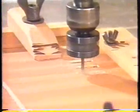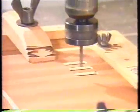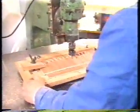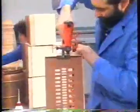During this phase, we can see, for example, how the bottom of the accordion base is worked, how the holes are made for the air which passes through the reeds to produce the magnificent sound of the Fantini accordion. The accordion sound box is then shaped and glued on the bottom.